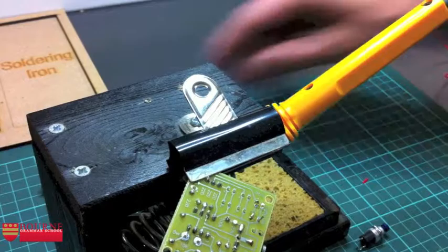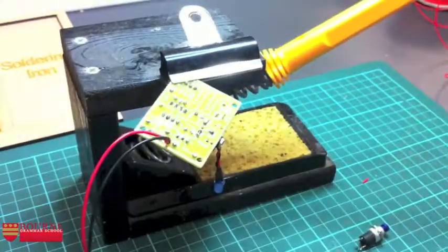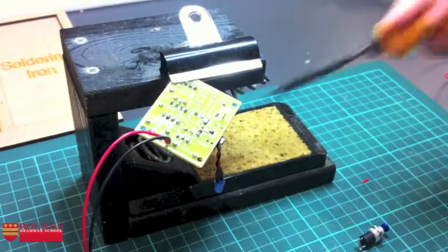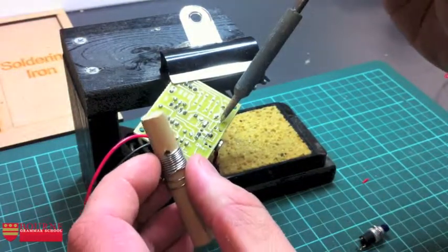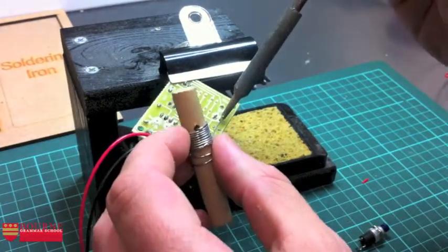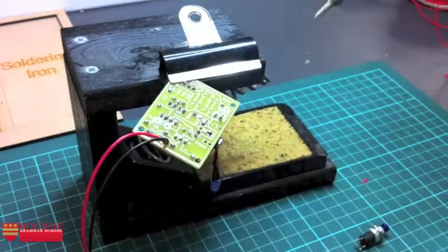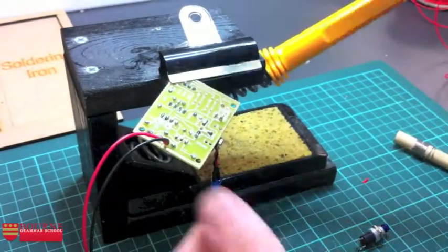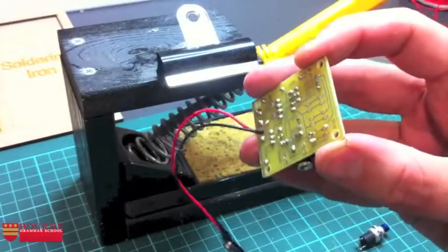get that soldered in. What have I put my solder? Okay, same as always. Soldering iron in. Count 3. Feed it the solder. A bit more. For some reason my solder isn't bonding very well today. There we go, that's gone on lovely. Okay, and then side cutter in and snip.